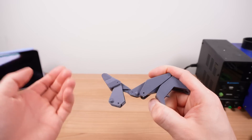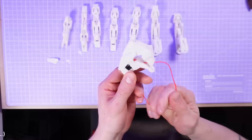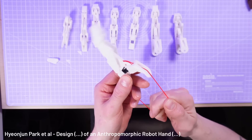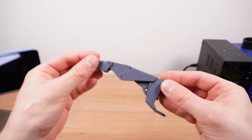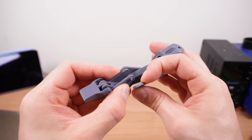This is because I designed the whole finger mechanism to print together in one piece and move naturally based on a system of linkages described by Hyunjin Park et al. The mechanism prints in place and is self-contained. All of the pivot points are enclosed within the finger mechanism except for one pretty important one which was on the end of a long, flexible lever. In the last video I threw this issue out to you guys and there were some pretty good ideas, but I really wanted to keep this finger design 100% print in place with no secondary processes — really for no other reason than I like the engineering challenge.